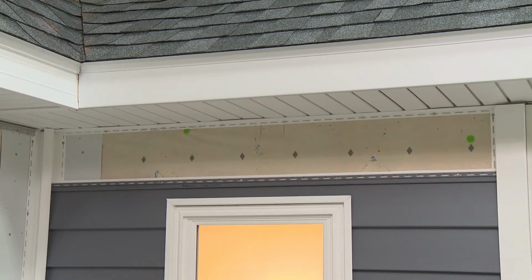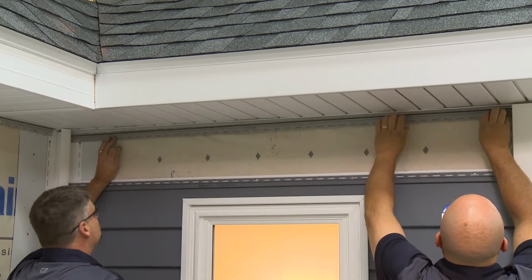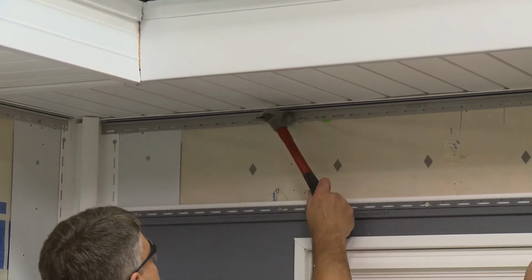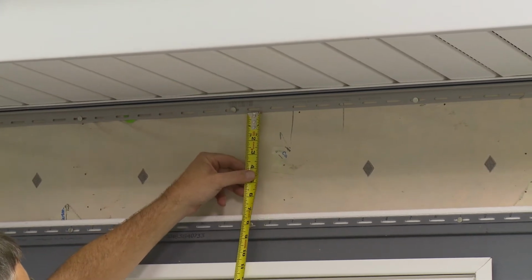Secure the last course of siding under the soffit with undersill trim, dual undersill trim, or a cornice receiver with finish board. We recommend the cornice receiver with finish board as it provides an attractive look and eliminates the need for shims. Prior to installing the last course of CedarBoards siding, apply cornice receiver beneath the soffit. Measure from the bottom edge of the lock on the previous panel to the bottom edge of the nail hem on the cornice receiver and subtract a 1/2 inch.